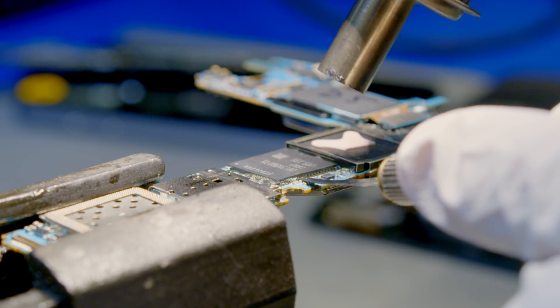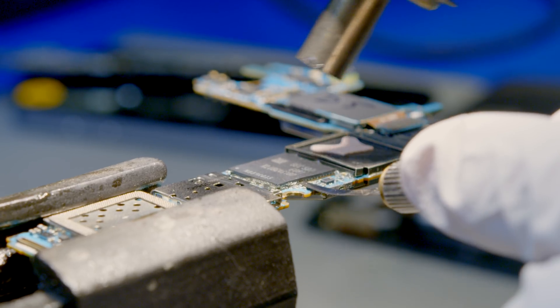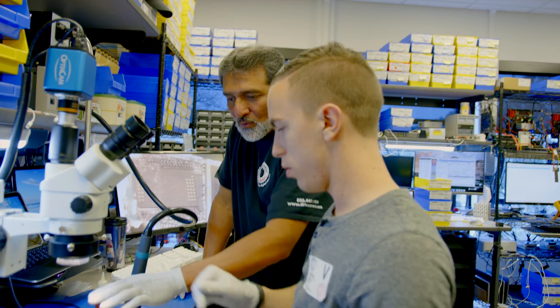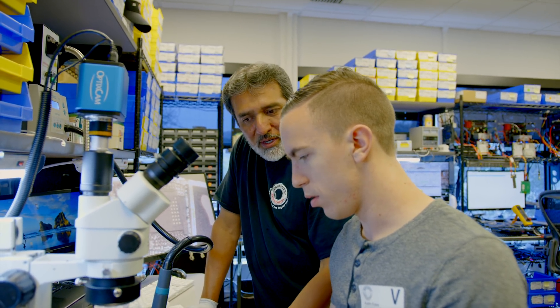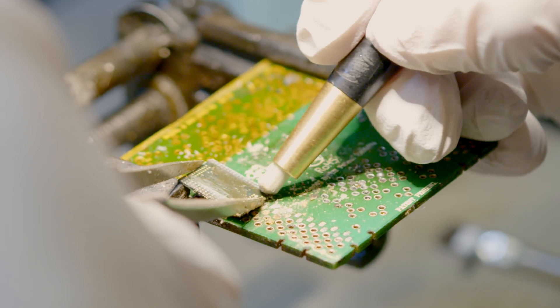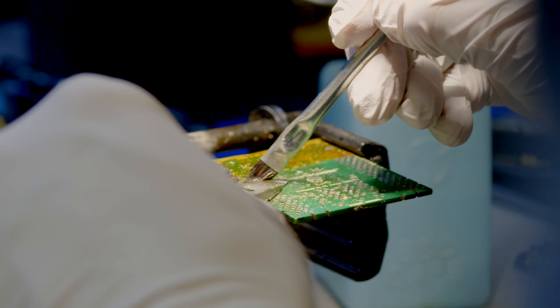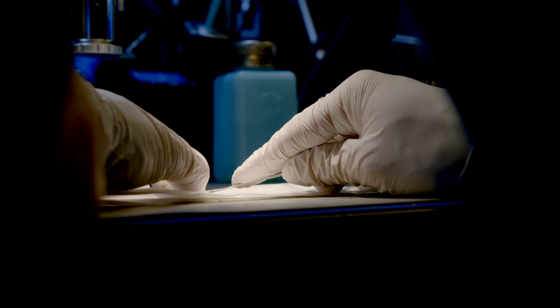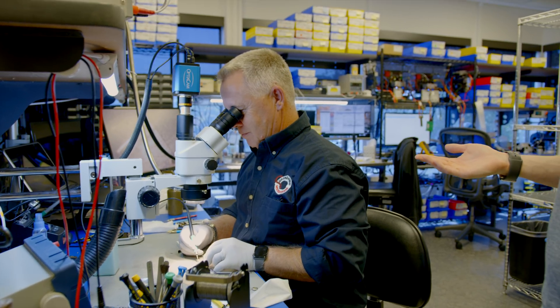I got the first corner up and started working my way down. We're not going to put the NAND back in the phone — we have a special reader for it. We'll take off all the silicone, clean it off, and re-ball it so it fits in the reader perfectly. As it should be a surprise to no one, I am a failure. That's why you send your phone to DriveSavers, not Austin Savers. I got it maybe 40% ready.